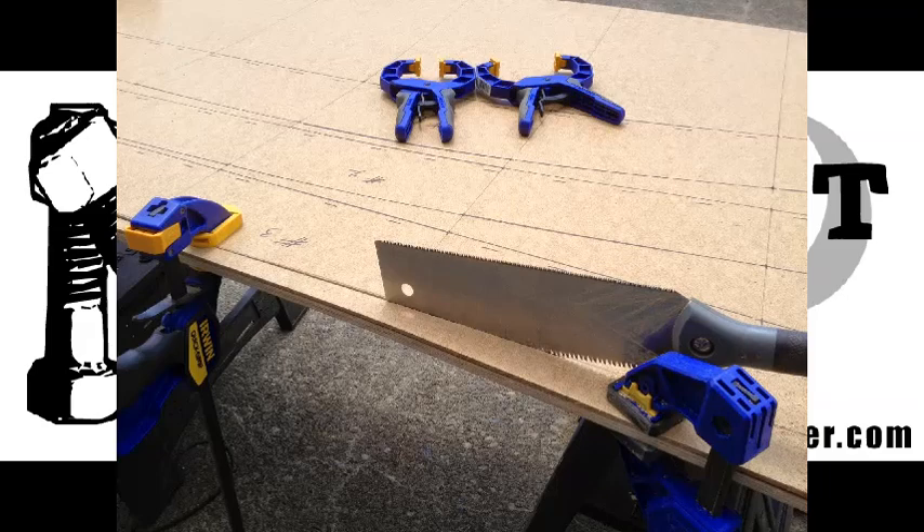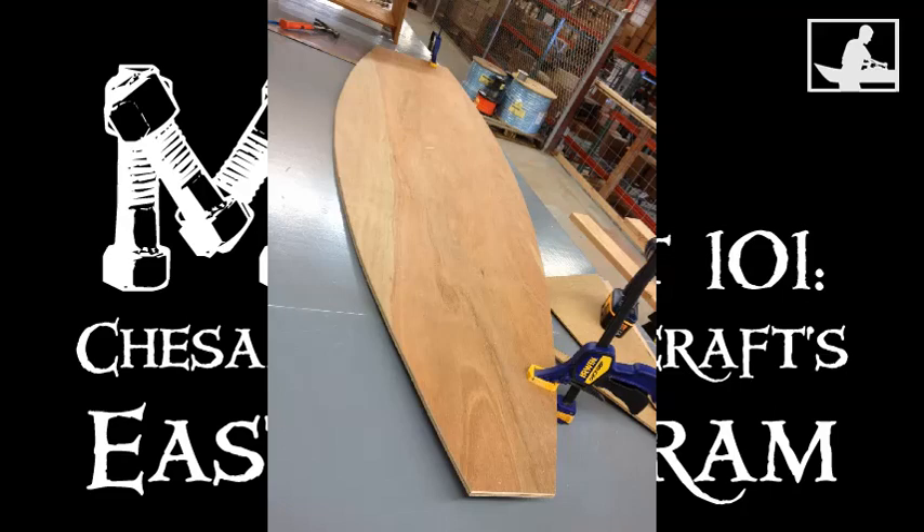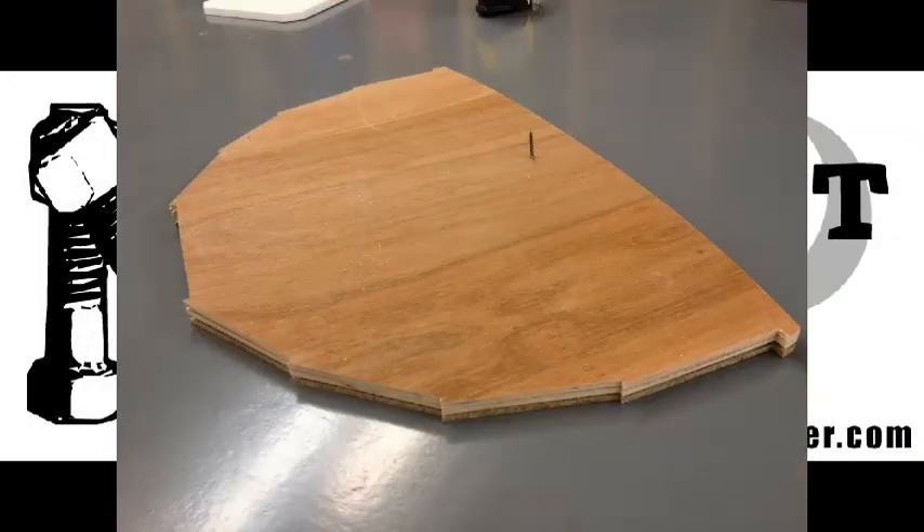I started out by drawing out all of the parts on Masonite, which is called lofting, by locating dots according to the drawings. These are called offsets. Then, using long, flexible pieces of wood called battens, I connected the dots with a Sharpie marker. I started to cut out the parts with a jigsaw, but that wandered too much on the graceful curves. I settled on cutting them out the old-fashioned way with a Japanese pull saw by hand. These saws are flexible and cut on the pull stroke, so they're perfect for following the long curves on the boat parts. I also took the opportunity to cut each part out of Masonite so that I automatically have a template if I ever wanted to make another boat. That way, I wouldn't have to do the 10 hours of lofting.